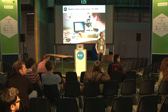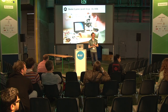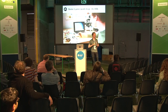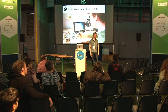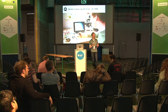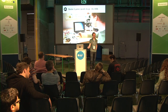How bad of an idea is it to make these things out of cardboard? Cardboard and water are not really a good combination, and in biology labs we often work with liquids - so that's tricky. But when you're prototyping, cardboard is a perfect and cheap material. You can quickly test whether things fit, whether it makes sense, whether you still put your fingers where they have to be. MDF is nice for a functional prototype, but MDF and water is also not a very good combination. Once you've settled down, it's good to make it out of some kind of plastic or finish it with a coating.